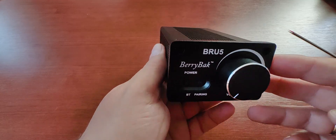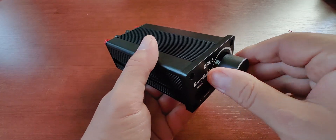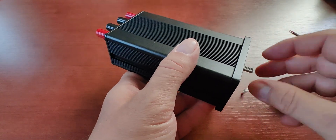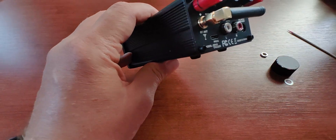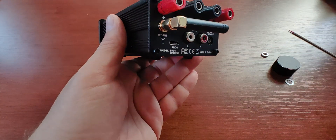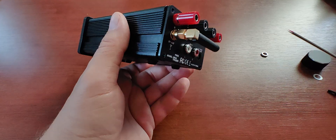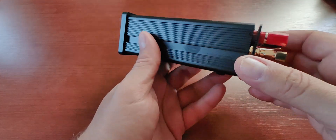I actually got it using my cashback money from one of my power amplifiers. To get inside, we need to take off the volume pot, unscrew the hex nut here, and unscrew four hex bolts on the back of the device. This little guy will have its own full review — this is just the first look, so you're taking a sneak peek inside.